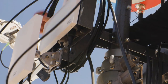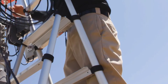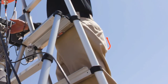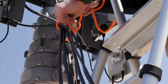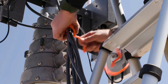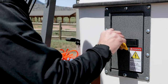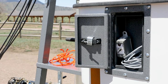The Ethernet cables are supplied affixed and secured to the Wi-Fi array. Following installation of the RF cables, the Ethernet cables should be unstrapped from their storage location and uncoiled alongside the RF cables. Use one of the flexible gear ties to bundle the cables together and prepare to extend the mast by ensuring that the cables will not snag when the mast is extended. Close the drain valve located at the base of the mast and remove the air compressor control pendant from its storage enclosure located at the exterior street side of the MCT unit.